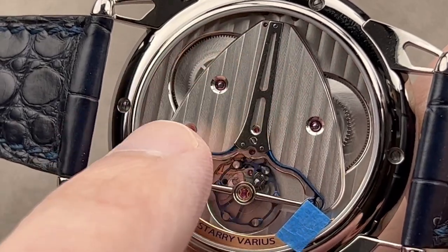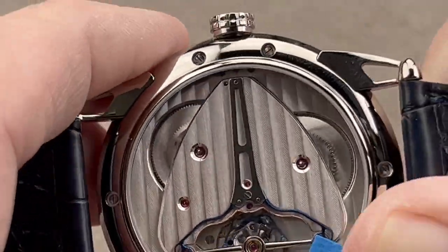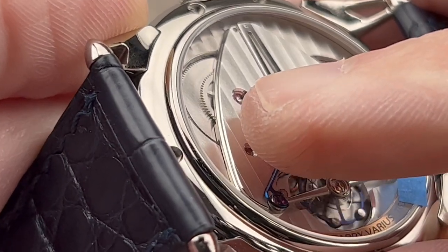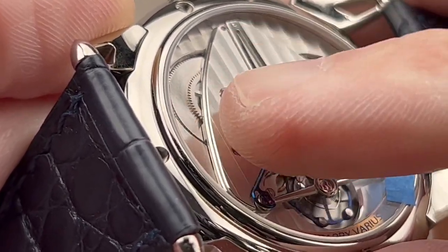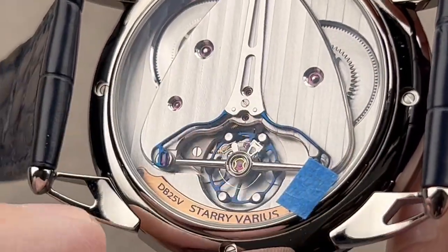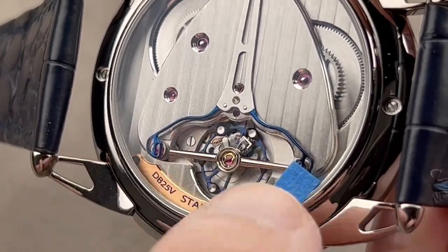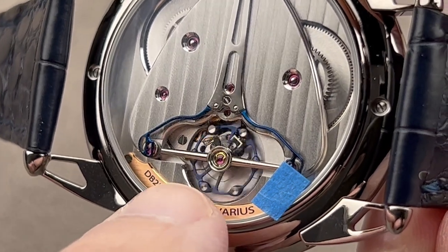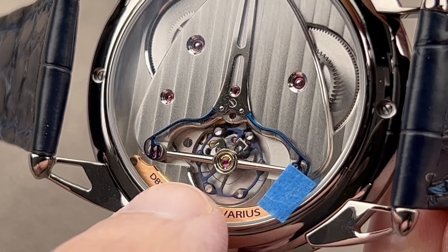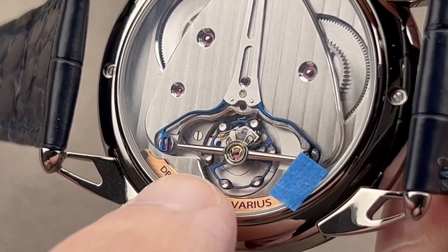In order to create those mirrored stripes, the reversing wheel that lays down the stripes is actually bidirectional — it's reversed to create mirrored stripes on the other side. The finishing is traditional. The barrel bridge and the cap atop it feature a rounded and broad mirrored bevel. There's solarization on the barrels themselves, jewel sinks are polished, and the springs outboard on each side of the balance have been fired blue. The balance is De Bethune's own — titanium wheel, white gold masses — reducing the impact of temperature changes on timing, but also the effects of aerodynamic drag.